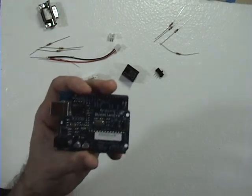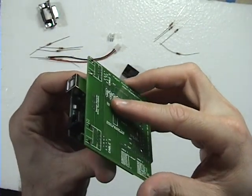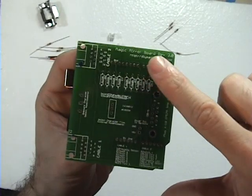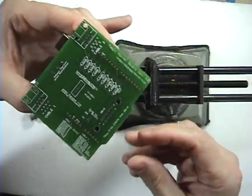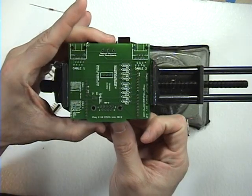And then take your board and just set it right on top. So now I've set the board on top and the pins are sticking out a little bit, and then I'm just going to solder. If you have one of these Panavises, it makes your life a lot easier. If you don't, you can still do it — it's just a little harder.